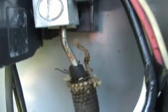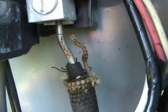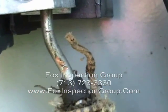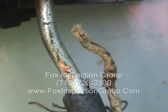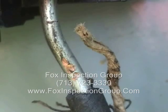I am looking at a wire that at first glance would appear to be aluminum, but if you look very close, you will see if the wire is nicked, you will see copper. To the amateur, at first glance, they would say that this is an aluminum wire — this is not an aluminum wire. This is a nickel-plated copper wire.